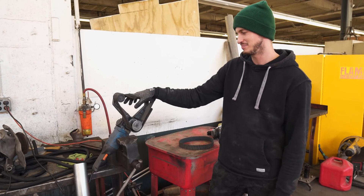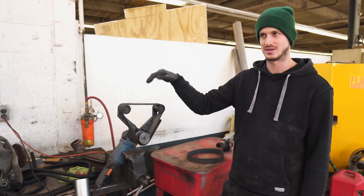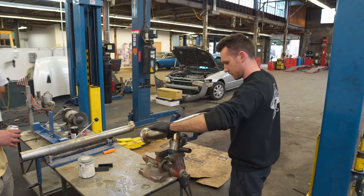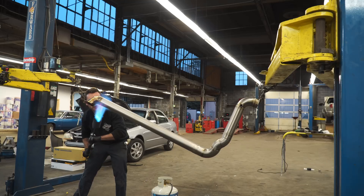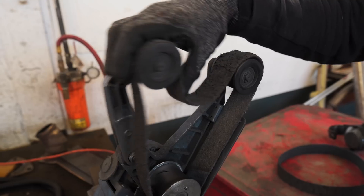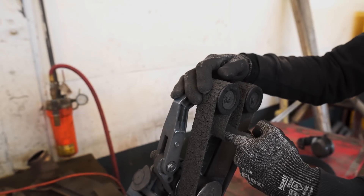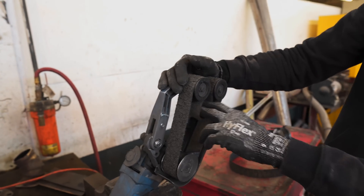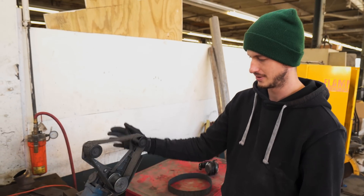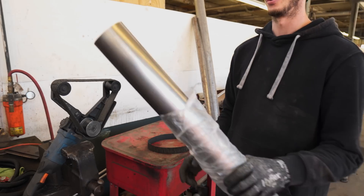So this is how I put a nice finish on the parts that I make usually. You guys have probably seen it in the 240 exhaust video where we put a finish on this before we burned it. It's just a generic tube and pipe sander. You'll see these a lot — people who make handrails and stuff like that use them because it goes around the tube or pipe that you're polishing. It can get probably 270 degrees around it at once, which just saves time. You're not going to do that on a belt sander, so it's a specialized tool to help you accomplish a simple task.